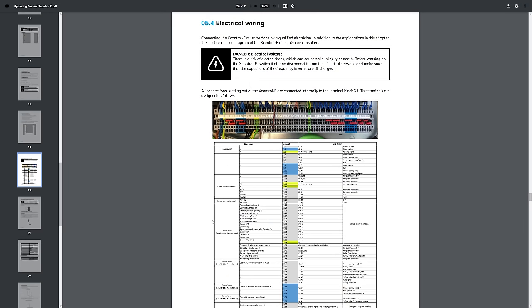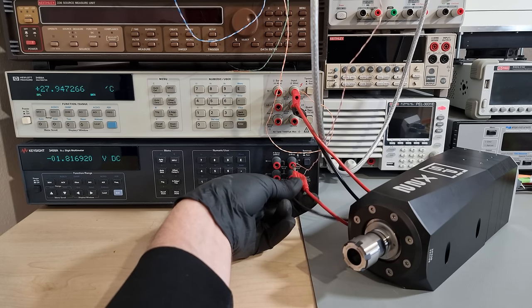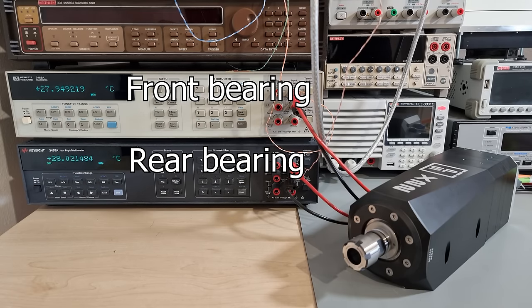Then we've got a couple of temperature sensors throughout the assembly — these are all optional. The cheapest eBay import spindles give you none. Our maxed-out X22 has no less than three: a PTC with which the variable frequency drive can automatically monitor the motor windings for abnormal temperatures, and one PT100 for each of the front and rear spindle bearings. I could imagine creating a Linux CNC component that memorizes the spindle temperature at every tool length measurement, and if there's ever a deviation of more than five degrees Celsius to the last touch-off, it could issue a warning and suggest a remeasurement on grounds of thermal deformation.